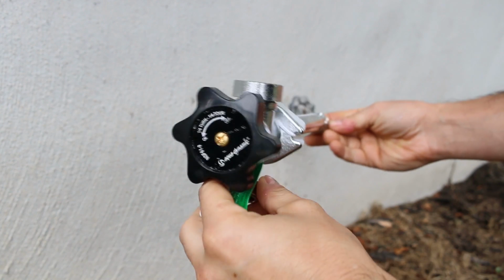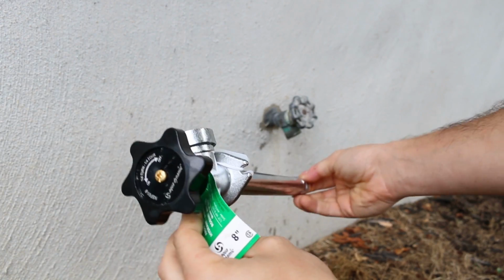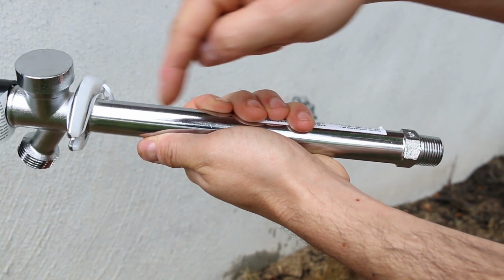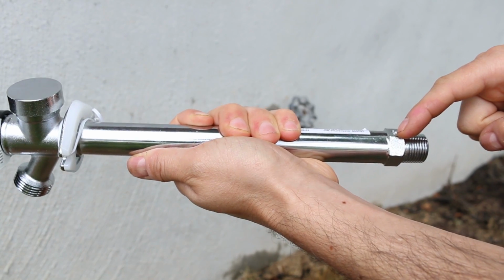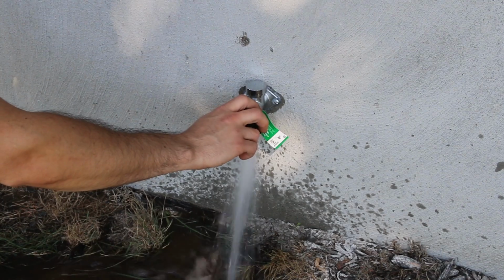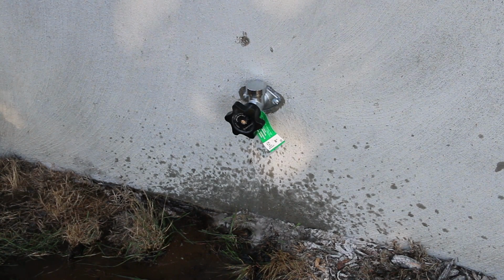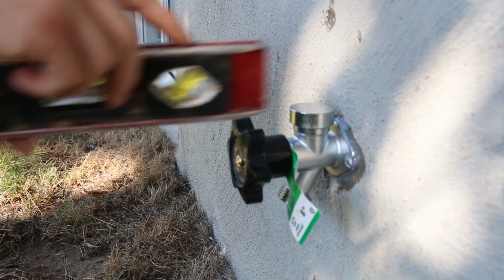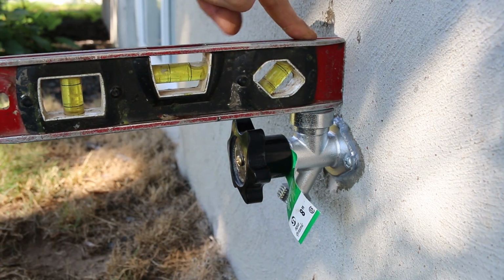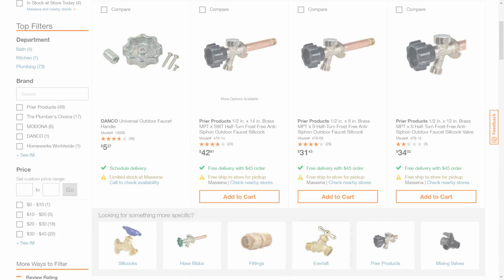The second preventative measure would be to install a Frostproof spigot. These special spigots have a long shaft in them which closes the water inside the house instead of outside, keeping the water nice and toasty. What's fun about these is you don't need to think of closing a valve inside the house when the cold arrives. And plus, there's almost no chance of it freezing if it was installed correctly. These go for around $50 depending on the size, and it's well invested in my opinion.